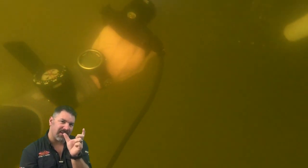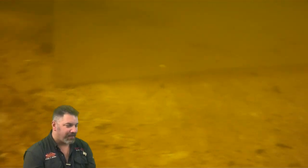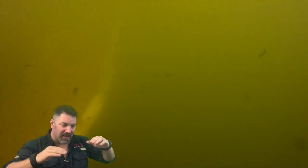On this particular vessel, there are slots in the side of the gunnels — that's solid metal, obviously — and that's going to be a good option for us to run straps. Although the boat is on the bottom, it's going to be hard to get up underneath it. So what we may have to do is lift it via those slots just enough to get straps and bags under it, then lay it back down and pump up the bags from there.